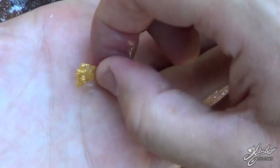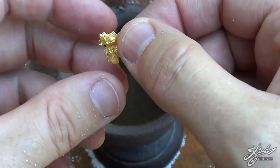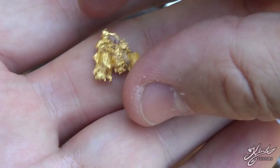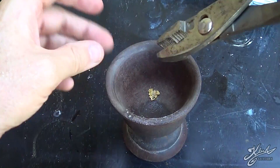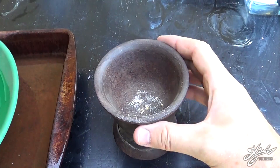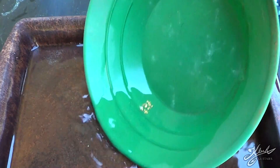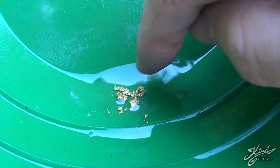Check that out — a nice little nugget! There's a lot of borax glass in there so the weight won't be accurate unless we crush it up and pan it out. Let's go ahead and crush it up to get rid of all the little bits of borax trapped in the gold. I just throw it in and take a pair of pliers and smash it up — that should loosen all the glass from the gold. Then we pan it off. We definitely got some nice chunky pieces of gold — I was not expecting that much.